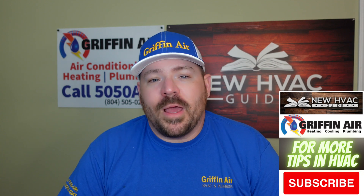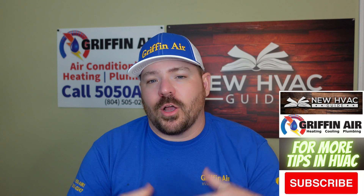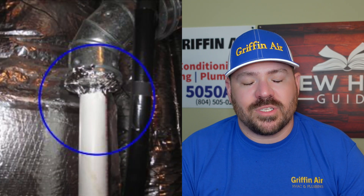Next, if it is a furnace and you have a flue pipe, keep that in mind. If you're going to move the furnace, you've still got to get rid of those flue gases somehow. In some cases you can abandon the old flue pipe, and depending on how far you're moving it, you may be able to reuse it and run it to the new location — but it has to meet certain codes, including proper rise. If you don't know what you're doing, please get a pro in there because you're talking about carbon monoxide. I've seen where people use the wrong materials — for example, a non-condensing furnace needs metal flue vent, B pipe, or single wall, and someone went in and put plastic, which is a gigantic fire hazard.